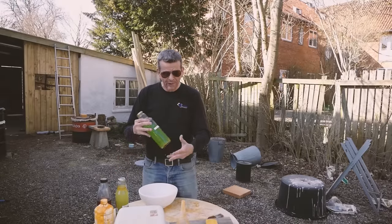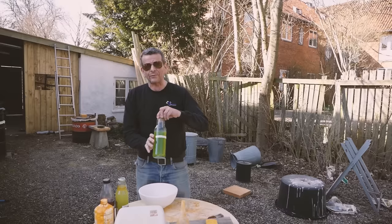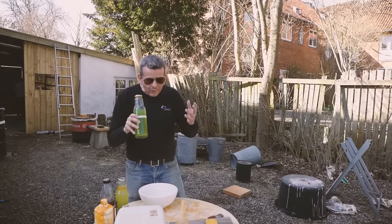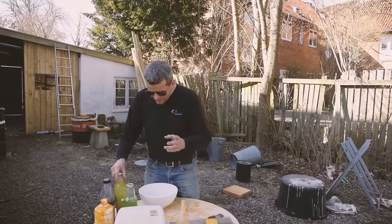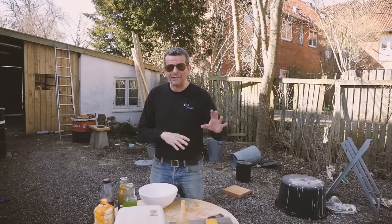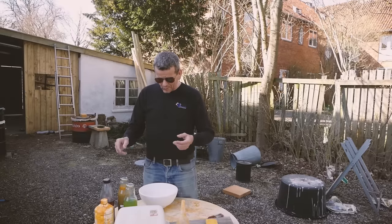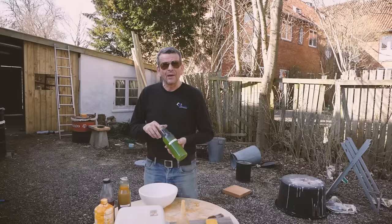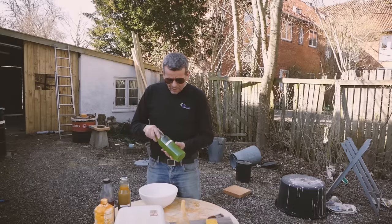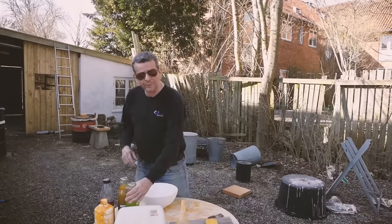I have also used a bit of sulfate. This is a copper sulfate and this one is the cobalt one. The copper can create greenish colors if it's very oxidized; reduced, it will be a little more reddish. But today I also mixed up a bottle of iron sulfate. So these are three different kinds of sulfates that react nicely in the pit, create some fumes and stuff. I usually pour it over, let it soak in a little bit, take it out, pour it over again — at least two coats, even three or four coats. I mixed a little bit more copper in this one than I initially did, and that helped produce more vivid results. The iron sulfate is great — that always produces great results.